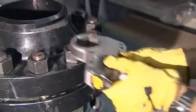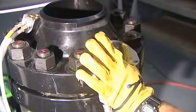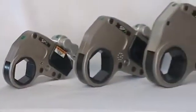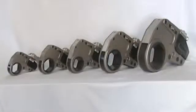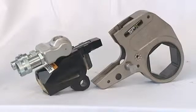Hydraulic torque wrenches are designed to tighten or loosen fasteners which require large amounts of force to achieve proper preload. They come in various styles and sizes. Typically there are low clearance styles for applications that may have overhead clearance issues or tight space restrictions, with an interchangeable link that fits directly over the nut.